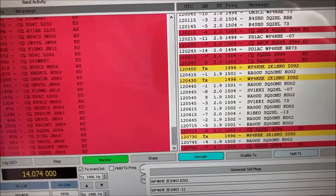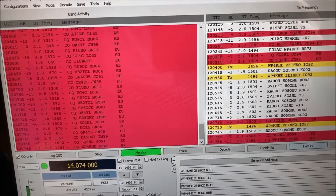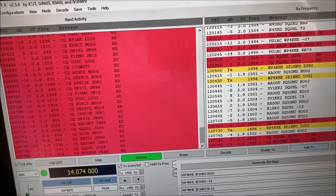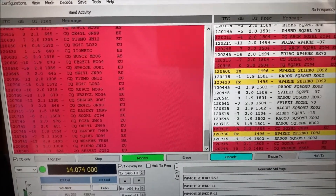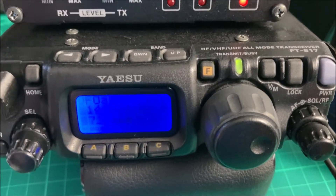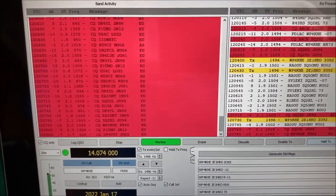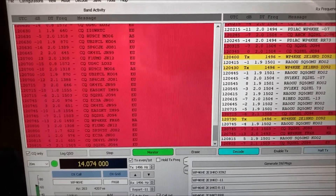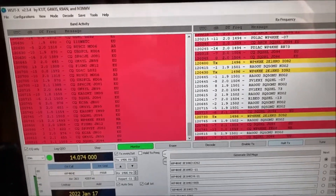I don't know what people's views are when it comes to digi modes and RF power — I try to use the minimum possible. FT8 as a mode is quite heavy on the radio as an output method, and I don't believe you should ever run a rig to the maximum. This is a QRP rig at five watts — I don't want to be running it to the maximum, so I'll just have it on the lowest setting, which will be one watt. Anyway, I'll say 73s. I hope to get out soon and do some more portable, along with data modes. All the best, 73.